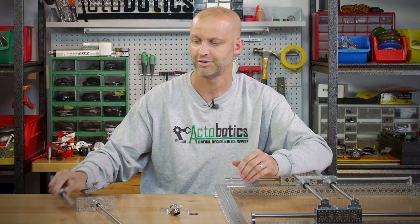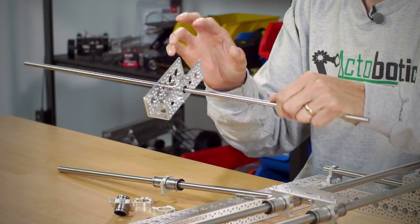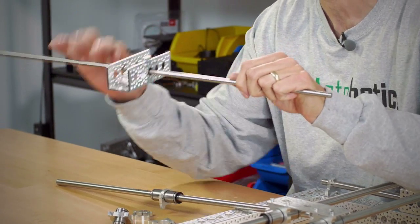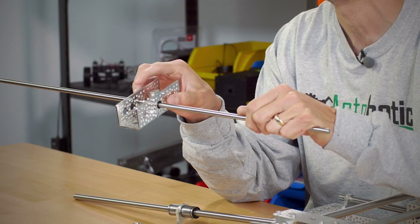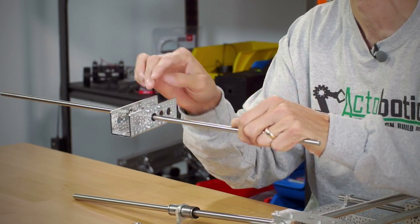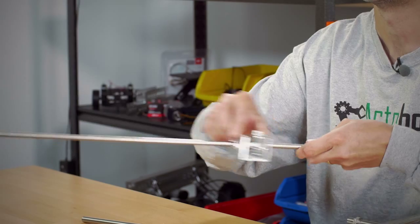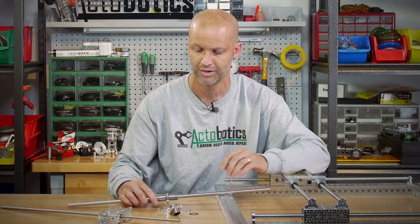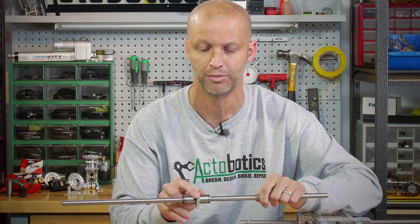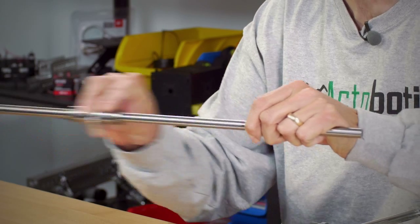So what can you do with all these? I'll show you this one first. This one has the 8mm ball bearing in it, 8mm precision shaft. We have this one perpendicular to the channel, mounted inside. Now you can slide it back and forth — nice precision type movement. But for even more precise movement, you can actually take two of them and double them up on any of these mounts, so that way you get really extremely smooth, precise movements.